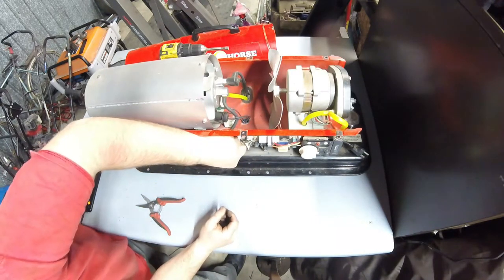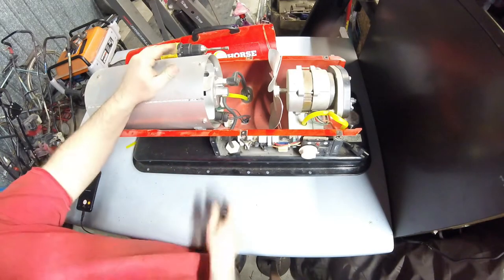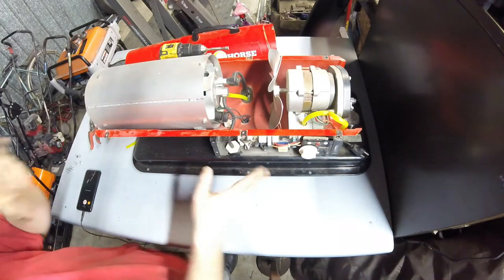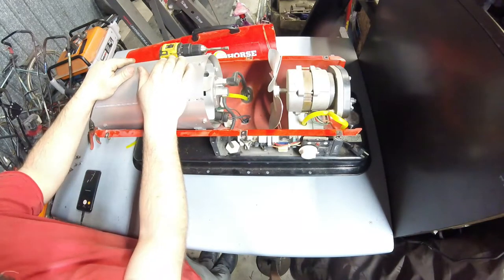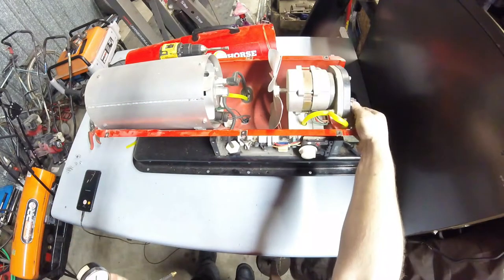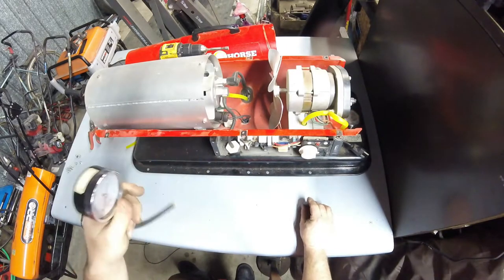Sometimes when you have loose fitting, low pressure hoses like these, you end up having to do something like clamps, or in the case of something as low pressure as this, you can get away with even using zip ties on the barbs, and it holds it on pretty well and seals up well. But in this case, we got good fitting hoses. We don't need that. But we have new hoses installed. So what I'm going to do now is break out the air gauge. It's part of what I do, especially when dealing with air system problems on these newer ones. You can see it has a thermosensor, or a photo cell.